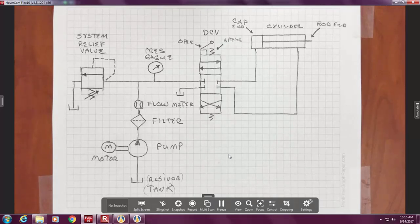If they've meant that it actually ties into a line, as you saw then, can I borrow this again? Sure. This line is showing, oh, we added a manifold, and the manifold goes to tank. So on the tank, there won't be four fittings, but there's a manifold added. A manifold is just a pipe with holes in it for multiple taps. There's nothing inside of it. So now we're going to look a little bit at how this operates, and then we're going to add that to our drawing.